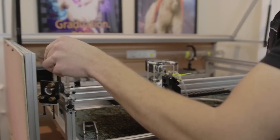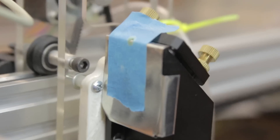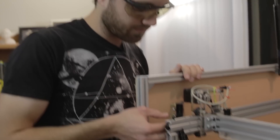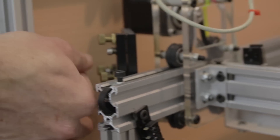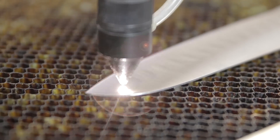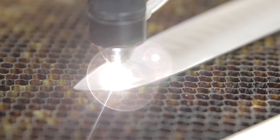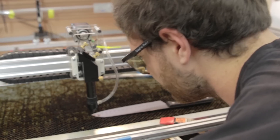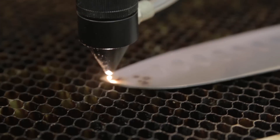Since we very recently moved the laser cutter, I'm going to make sure the mirrors are still aligned — any slight misalignment will cause the beam to deflect at an angle we don't want. Did that go through? Sounded like it went through. I see air coming through, sparks coming through. Putting some aluminum foil underneath the cutting area because the aluminum is really reflective and if the beam stays in one spot too long it will burn the bottom, because it is wood. If you can see stuff coming out the base, it's definitely made it through — it's just a really really tiny hole.